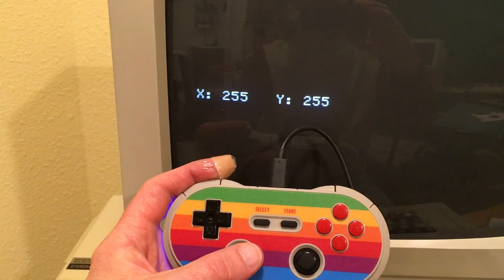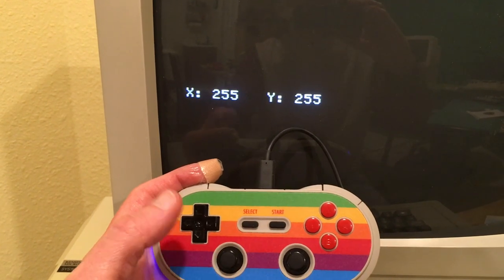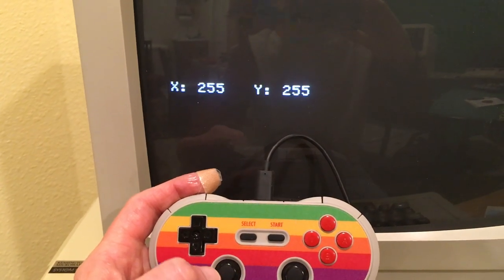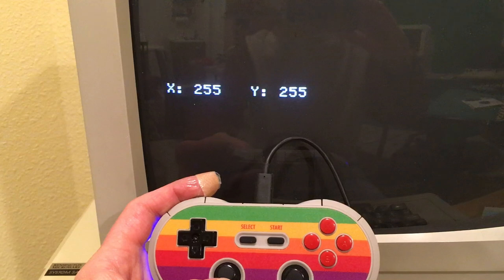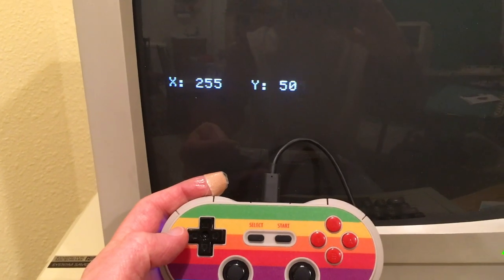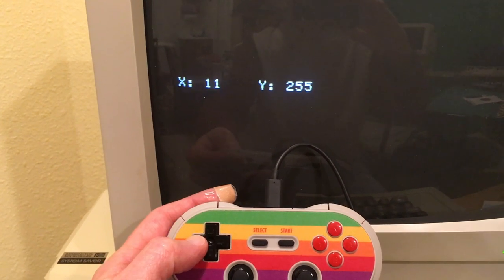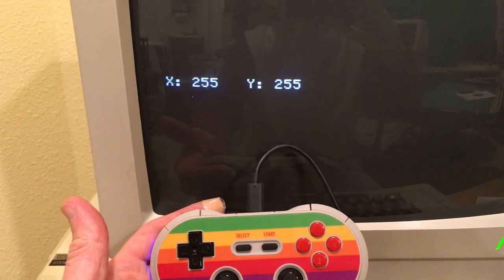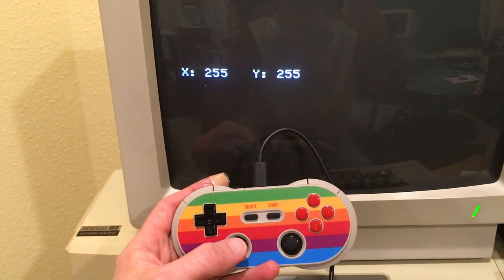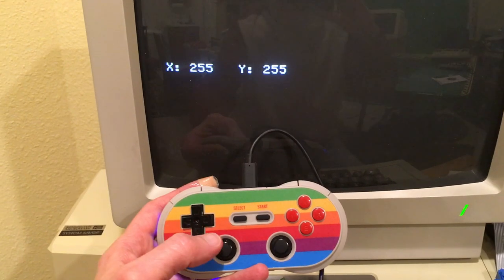I can try and move the X-axis and I get a few intermediate values, but it really just jumps between 11 and 255. Moving over to Y, I kind of get nothing — it's the same thing. I can get it to jump around a little bit but not much variation, and definitely not smooth. For the d-pad it's 11 on the left and 255 in the middle; for Y it's the same thing. For whatever reason, the Apple II Plus — maybe because of the 16-to-9 pin adapter — just doesn't respond as well.